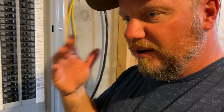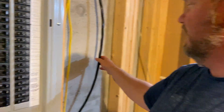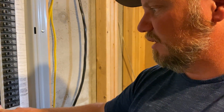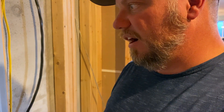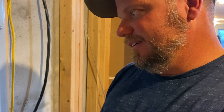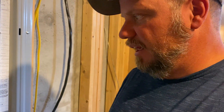He looked up the wiring charts and how much power the six wire would hold and all kinds of stuff. One of the questions I had was whether 50 amps of service would be enough. Ford offers a couple of different varieties — they offer the mobile charger I have that does 50 amp service, and they also offer a bigger box that offers 60 amps of service. A lot of my friends did 40 amps, but a 50 amp breaker was only a few dollars more, so why not? And the six gauge wire will handle 50 amps of service — so that's what I went with.